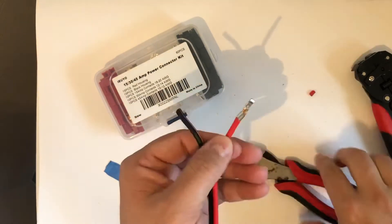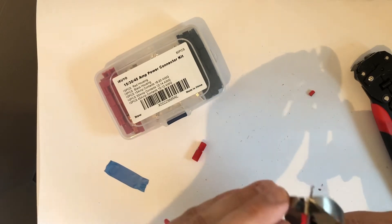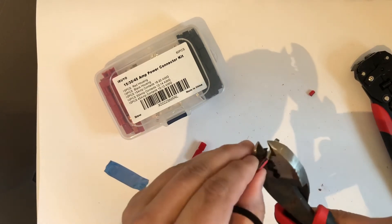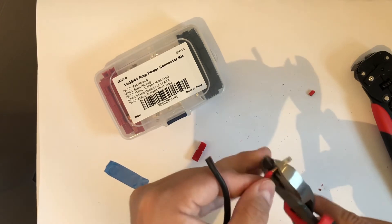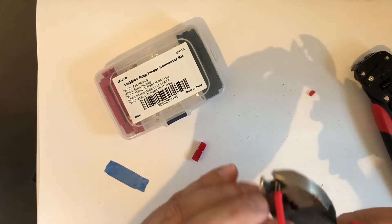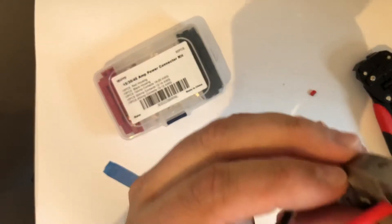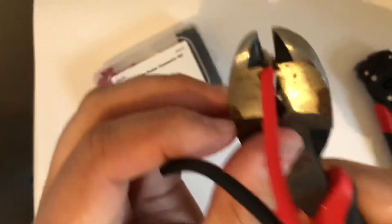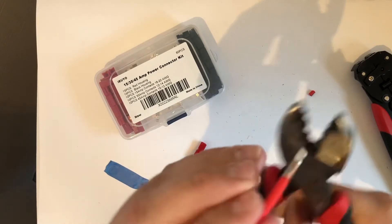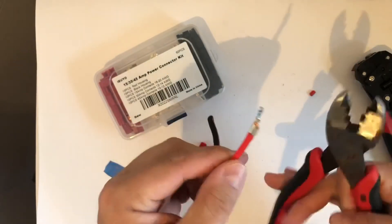You can see it stands up on end — that's okay. We're going to come back and put it in the 12/14 slot this time. Set it in there at about a 45 degree angle, flat end up, at about 45 degrees. You can see it right there. Then just give it another squeeze and close it up. That's going to make a tight connection so it doesn't come off.